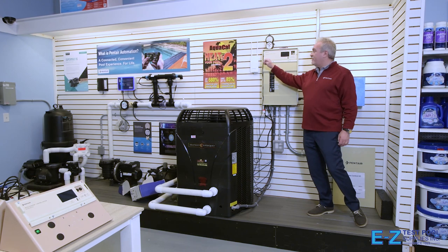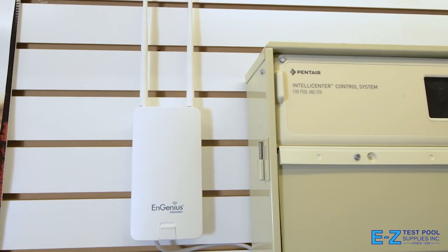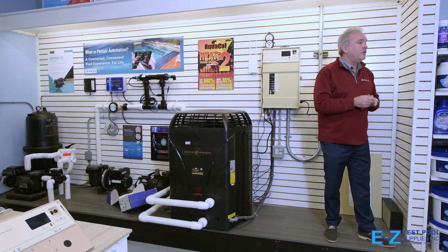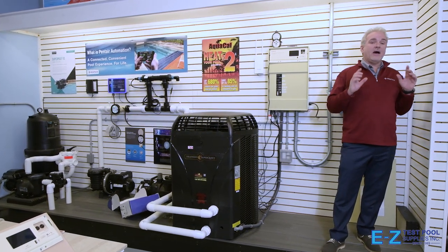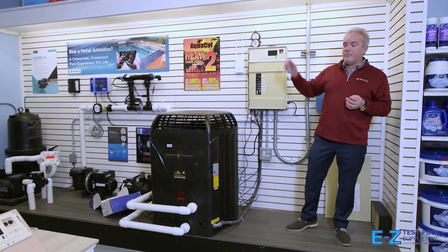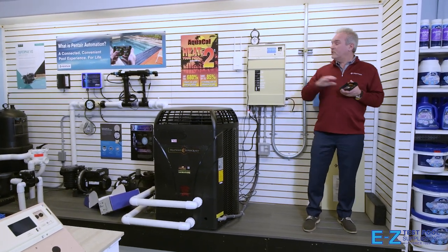On the internet connectivity side, if you're using the built-in wireless antenna, it works on 2.4 GHz. There's 2.4 and 5.0 GHz, and you'll need good tools if you don't have a solid wired connection. We recommend the N300 Wi-Fi extender, and also our outdoor-rated AC600 antenna, which comes with 15 feet of cable. You can mount it on the eave of a house and extend it up to 100 feet to get better signal where you need to place that antenna.